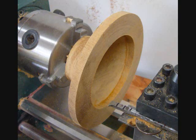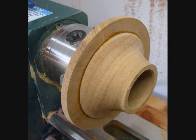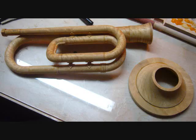I hate doing bells. They're very time-consuming and difficult to maintain a consistent wall thickness and correct taper, especially by having to move both dials simultaneously. I have to plan this out carefully and leave flat areas that I can grab with the lathe as I work on both sides. Double check fit and shape over and over on this critical piece.